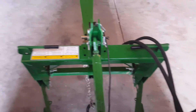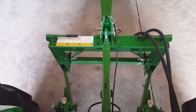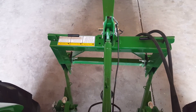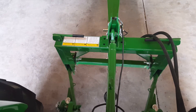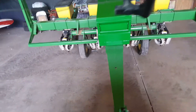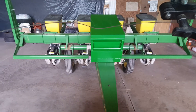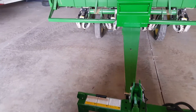I've got the planter plumbed and I pull it from the three-point. I never really explained that in earlier videos, but I pull it from here because the drawbar height is just too low on these compact utility tractors. This planter is from 1978 — pretty much when I was born — and the drawbar was a little bit higher on those bigger tractors back then.